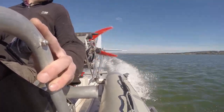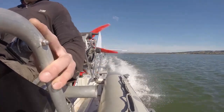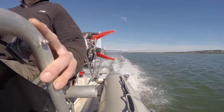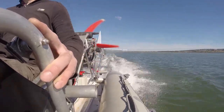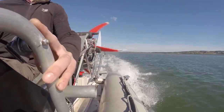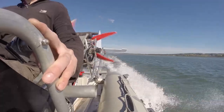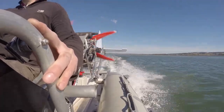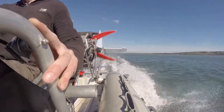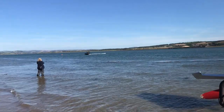Something I've come to understand about a situation where you have a boat controlled with an aircraft tail is that with a tailwind you have very little control surface authority. This is because the boat will only go so fast with the addition of the tailwind because of all the water causing drag. I think an aircraft would go much faster with a tailwind and flight control authority would be less affected. Airboats then must suffer from similar effects, a reduction in control downwind,